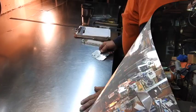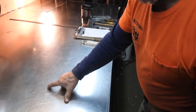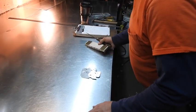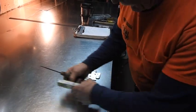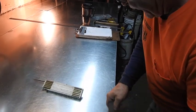Actually, in the direction of travel, it's going to be going in 8 inches and out 10 inches. Got to get a rough idea of what it is that you want to do. So I'm envisioning a radius that goes like this right here. So I've got a 6-inch throat on one, so I'm going to come up from here. Actually, I'm going to mark a 1-inch line down here for the S and drive.